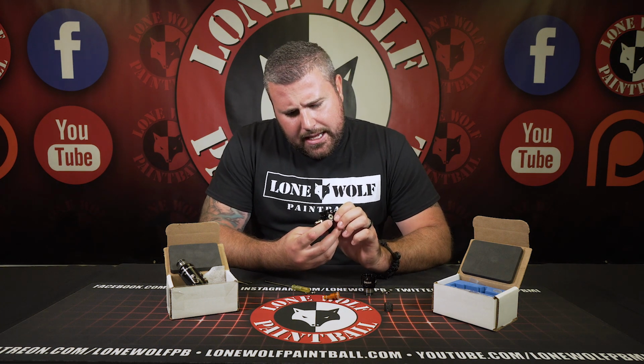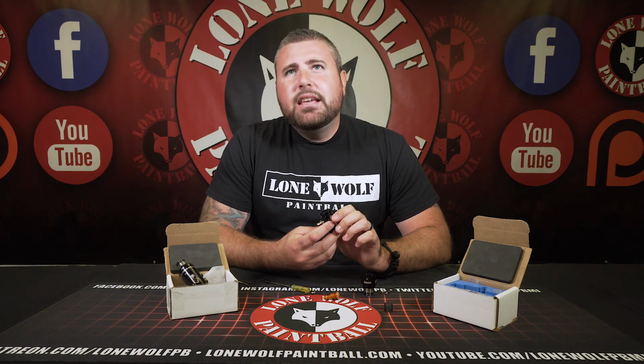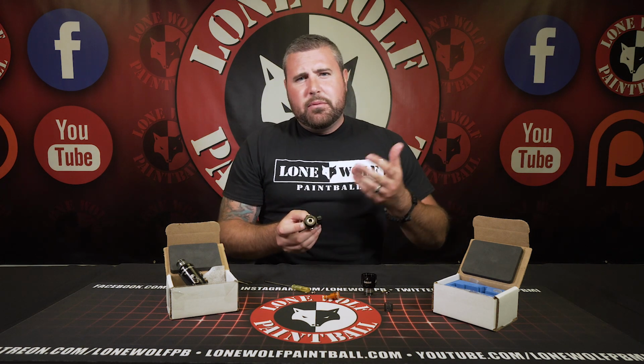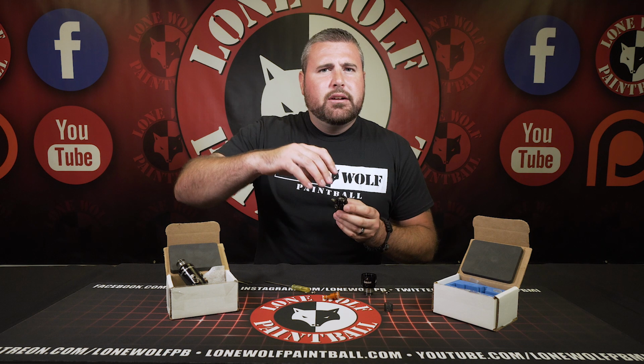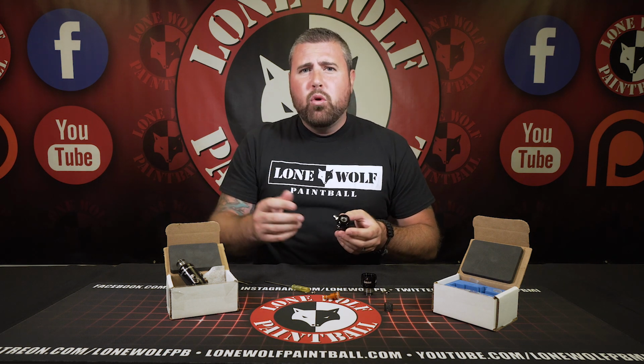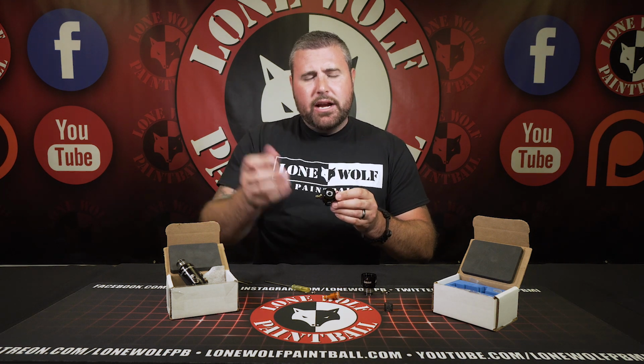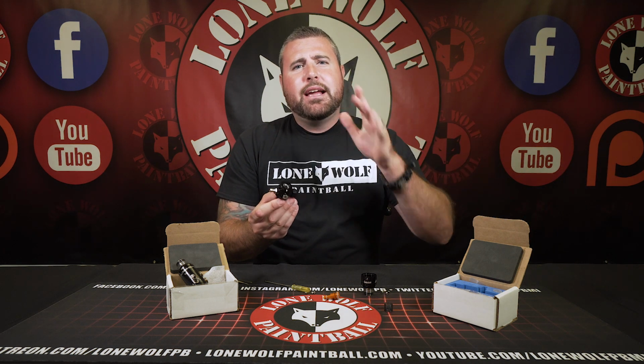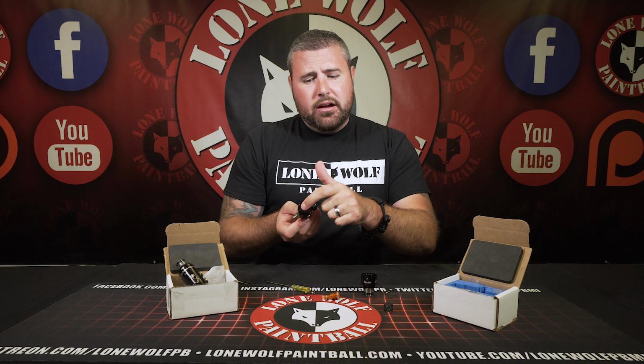So you're doing micro turn adjustments to estimate the... Correct. As of now, I'm trying to get further confirmation from Powerhouse as to whether it's a quarter turn, less than that, or more than that, to actually lower or raise it. But it goes anywhere from 400 PSI up to 700 PSI output pressure by the adjustment inside of the tank.